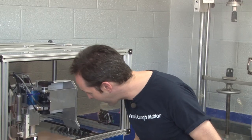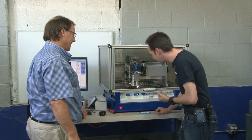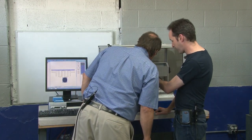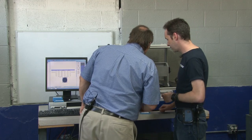That's fast. It is — for such a tiny bit, the surface speed is crazy high. Now I see it's not going all the way through in the first pass. Is it going down in steps? It is. Or did we screw something up? What we did is we put a drill bit in instead of an end mill — we should have put the 32 mil end mill. So it wants an end mill.